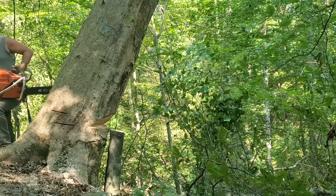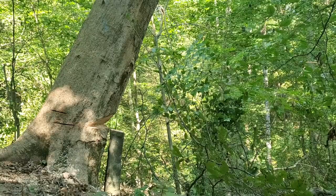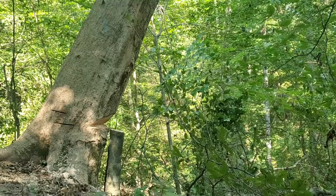That baby is trying to set on my saw something awful. Now what this has done is - that stump - if that tree tries to open up on the hinge, it's locked against the back of the stump. So now all you gotta do is punch through and cut her off.